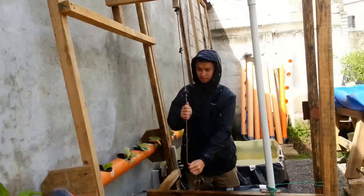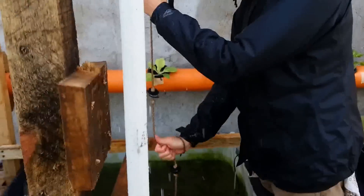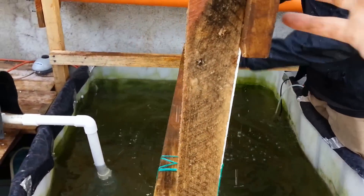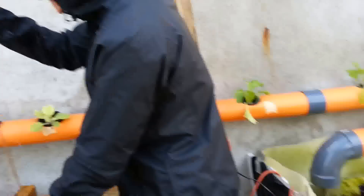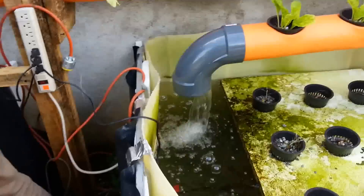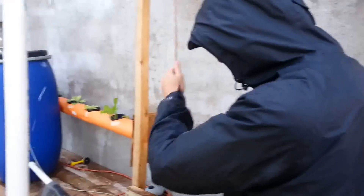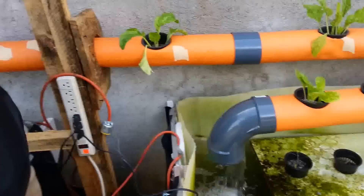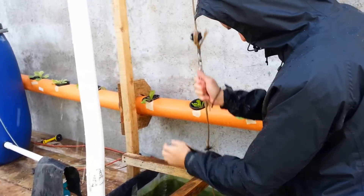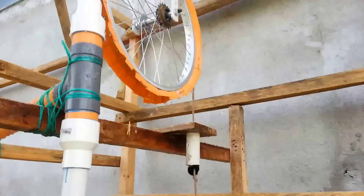See that's how hard he's working and how much production we're getting. If we do get a welder, we could go ahead and put our chain back on, going down to our crank pedal with a metal frame that won't move around as much as these rough-cut two-by-twos. But really this works great — he can do that for about five minutes and the water will flow out for about 15 minutes because it fills up this whole pipe, and that's a lot of volume. That's basically a rope pump.